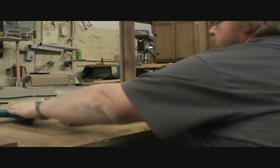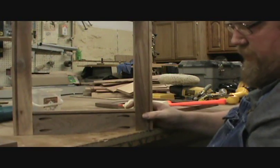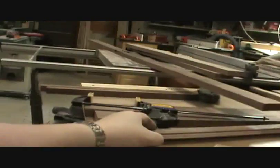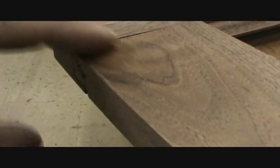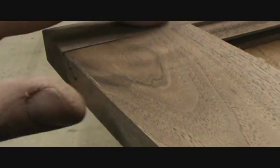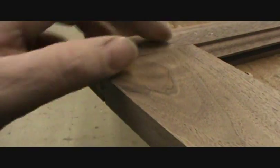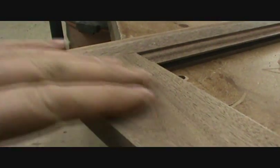But the way I build things, I've got it to a rough thickness. And when it goes through the surface sander, I haven't figured out if I got a planer that's breaking or what, but I haven't been using my big planer. I ran that through good side down. That should have been flush just like that there, and it didn't. But I've got enough extra there that when I run that through the surface sander, that's going to clear all that up, make it flat.